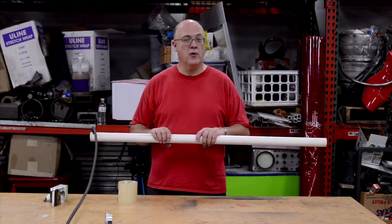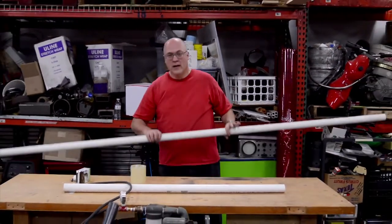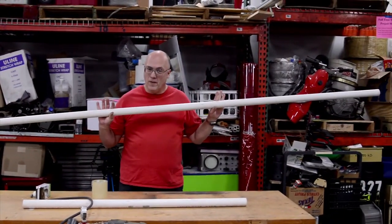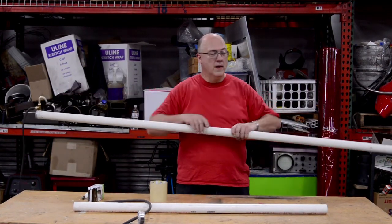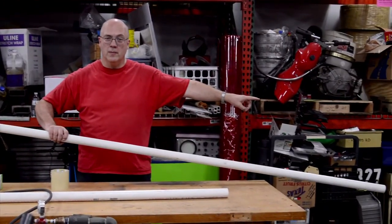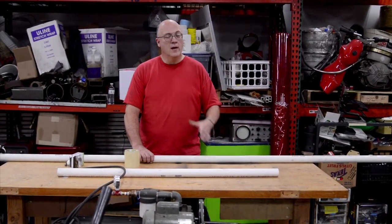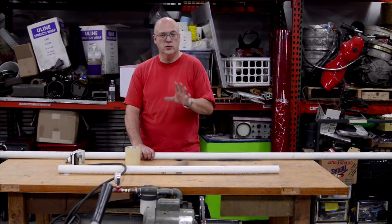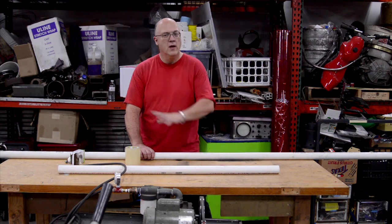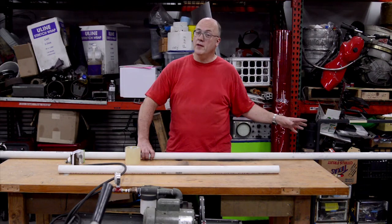But then we had to replicate the problem the Mythbusters had. Enter a 10 foot barrel, same as before, only a bit longer. Vacuum connection, gauge on the breech end where you load the ball, tape on the muzzle end where it comes flying out. About half the time we fired this cannon, the ball would not even come out the far end. This was the problem the Mythbusters were seeing where air was getting past the ball and actually acting as a brake before it broke out the end of the barrel.